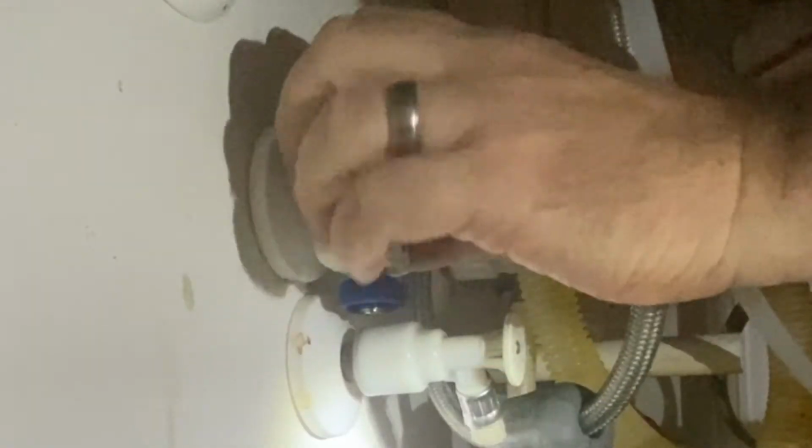So anyways, just twisting these with that pipe cutter on, and trying to get this top piece off. Basically, I was doing a rotation, and then I'd twist the end to tighten it up a little bit, do another rotation or two, twist the end to tighten it up a little bit, and repeated this process until I heard a click, that plastic broke.